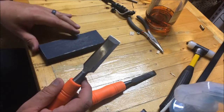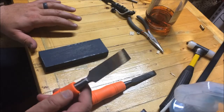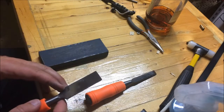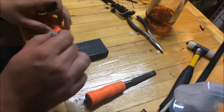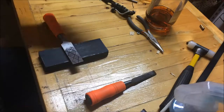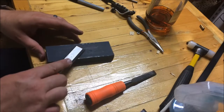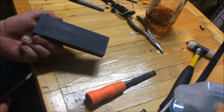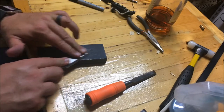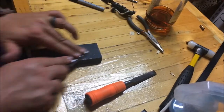I'm not gonna use the Tech Studios profile - I'm just gonna use this old stone that you guys have seen me use before. This here is a one-inch stone and I'm gonna start off on the back. You can see that the edges right there are what has touched so far, so I'm just gonna do a little bit of this. I've got some sharpie on there. I want to start on the back and I'm not gonna go to the coarse - I'm gonna only use the fine on the back. There's no damage to the back, I just want to make sure it's flat. This is where I always start with this process, right here on the back.